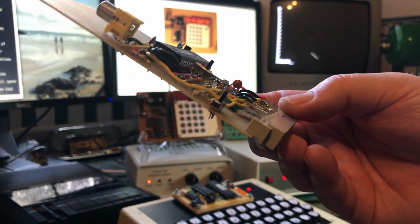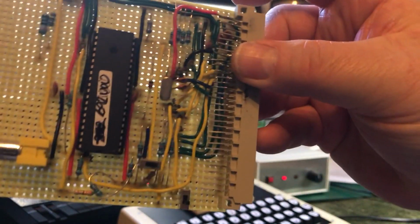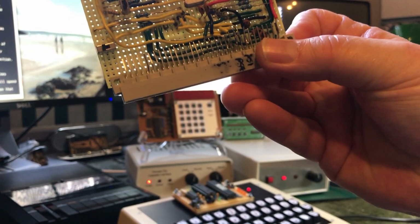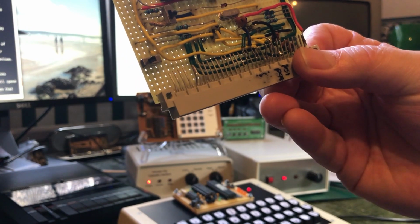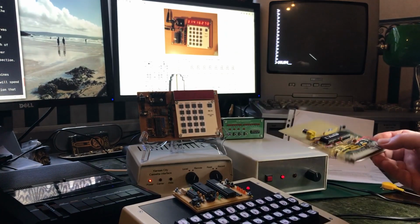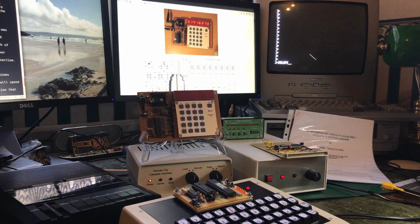It's just got one little hack on it that allows me to vary one of the resistors that allows the error we were trying to find to show up, and it's got the fixed capacitors now mounted on the top rather than underneath, which should delay the coming up of the address lines, which was actually the underlying bug that we found. So that was a subject of a bit of a flurry of activity, because Karen's last post, number 787, on the 30th of October, was while we were trying to find that last bug, and we did fix it with those capacitors on the 6th of November, and she sadly passed away a few days later.